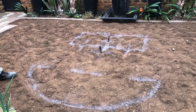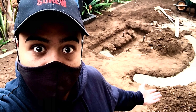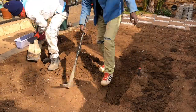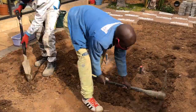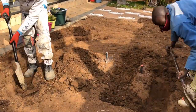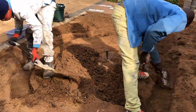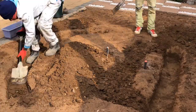And yeah, before the comments go wild, we did actually excavate a smiley face in my client's backyard. But anyway, we forged on because that's what she wanted. And so we got ahead with our foundations. We dug our foundations about 15 to 20 centimeters down and excavated smoothly along all the edges, just so that the concrete could settle and be quite solid when we lay it down.